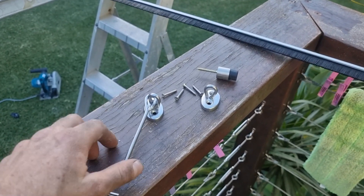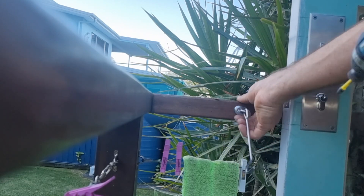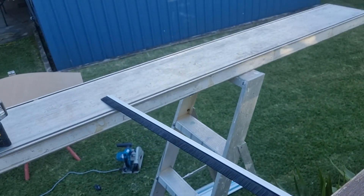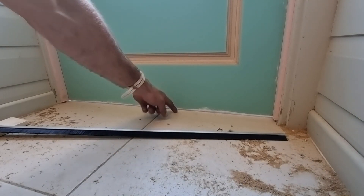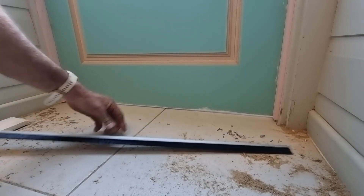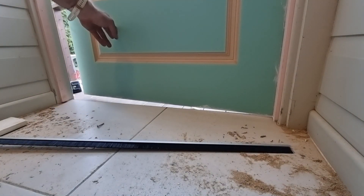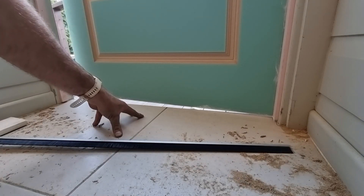I've got three final touches to put on: a latch so that when the door opens it will stay nice and in position, a door stop, and this weather strip on the bottom. The way it is, we want it hitting the finished floor on the inside rather than the outside - the outside is a bit lower. So we're going to put it in between door stop to door stop, which means when you open it it will look a bit short there and a bit unusual on both sides, but for the sake of this we're going for practicality rather than looks.